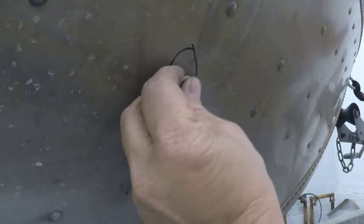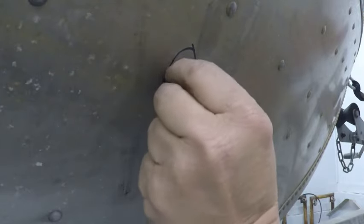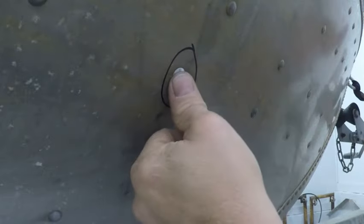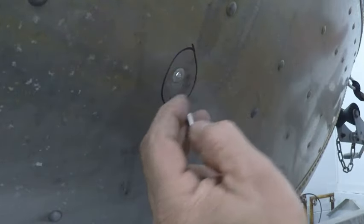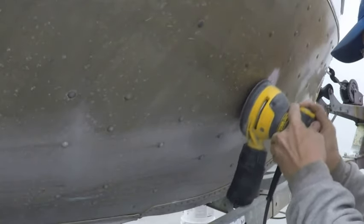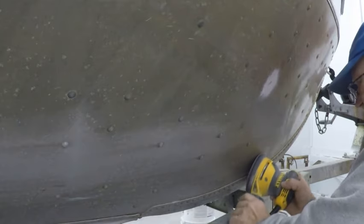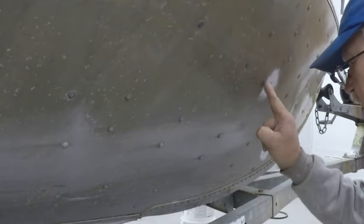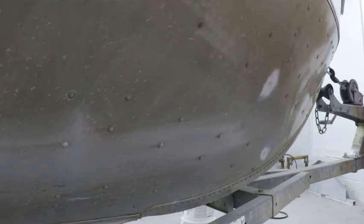When I go to do the impacts, it won't take but one or two strikes and that rivet will swell up. Once it swells up it locks in the hole, keeps swelling, pulling the head tighter, and the backside mushrooms down and locks it in place. There's another video coming out in about a week where I go over in detail how to put these in and what to look for. I got them nice and clean, which also lets me look for any cracks - both of these are perfect. We'll go ahead and get the bucking bar and riveter gun out and put them in. It's amazing how quick this is.